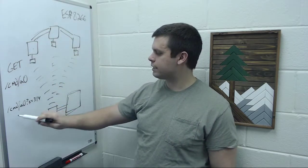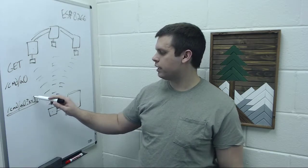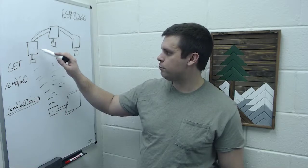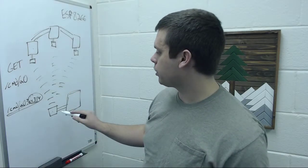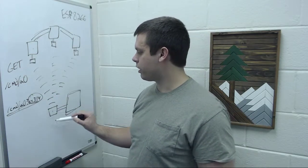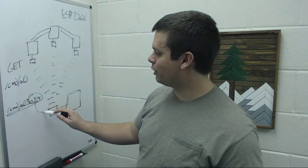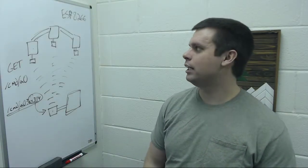When that request gets sent here, all that this server does is, okay, you're A0, this is a command. I'm going to send back the command, and then I'm also going to parse this S parameter in your query as, okay, that's the state of the actuator. I'm going to set the variable here. So now next time I communicate with the main onboard computer, here's your state of that particular actuator.